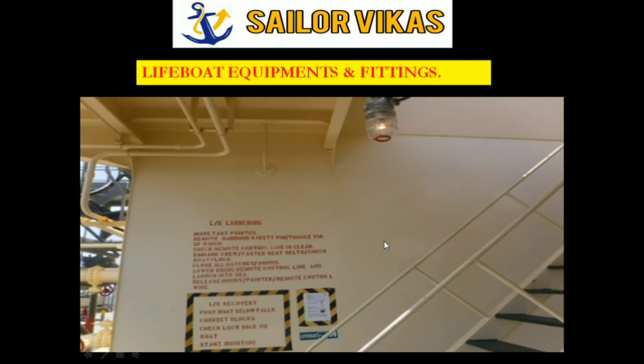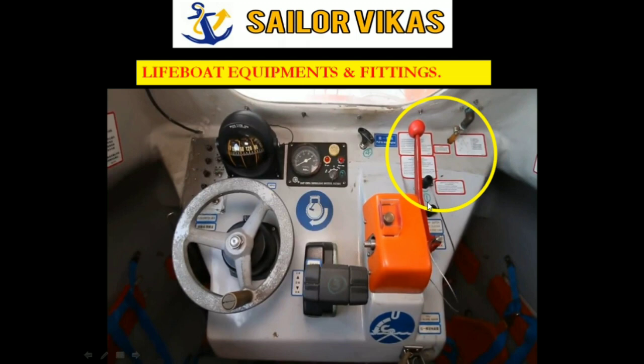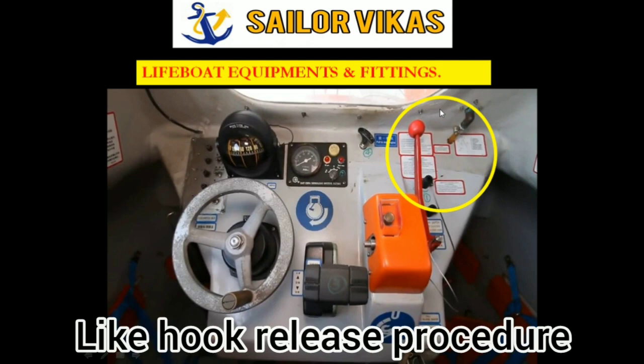And other than that marking, the wire renewal date should also be posted or marked or stenciled near the lifeboat. So as you can see here, wire renewed. And other than that, the markings for starting of engines and the procedure for starting of engine in cold conditions, and all the procedures which are related to the lifeboat, should all be posted here inside the lifeboat.